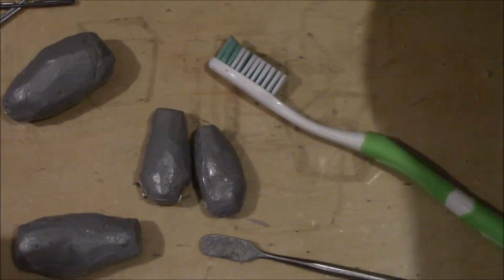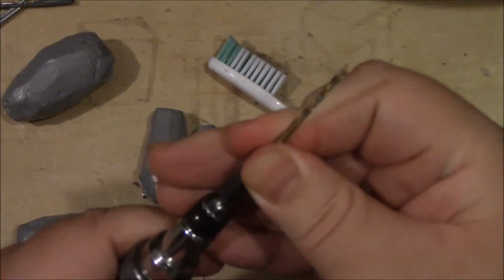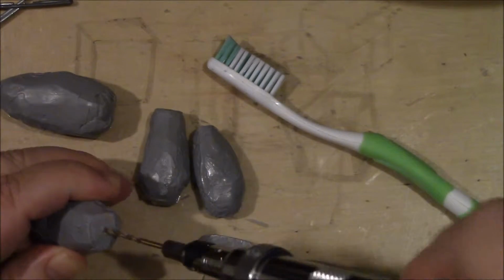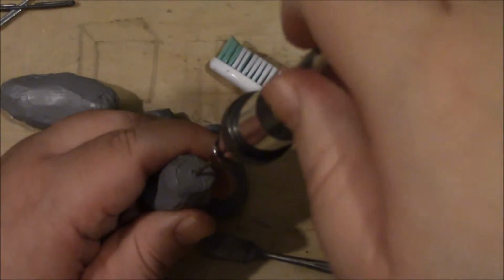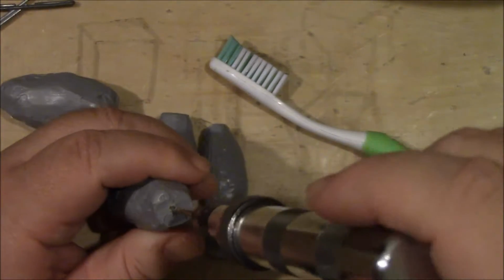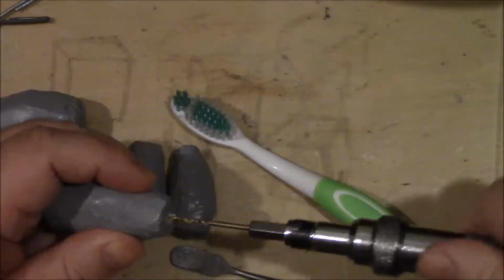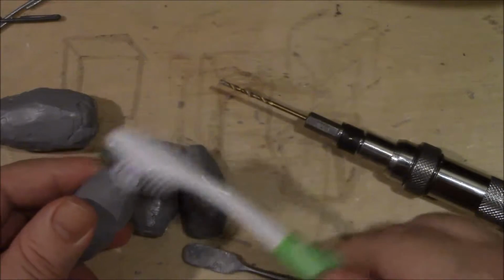So, once I have my holes created, I'm going to heat up the joint with a small torch, and I'm going to insert it inside that hole. If I didn't have that hole in there and I didn't have that channel, it would be kind of difficult to push it all the way inside there. So that's what I have those holes in there for. And also it helps me to guide it pretty much in the center.